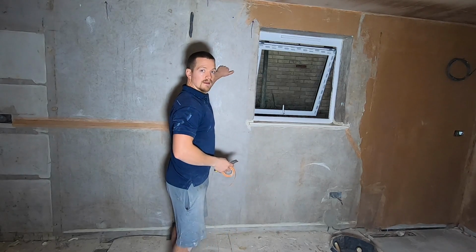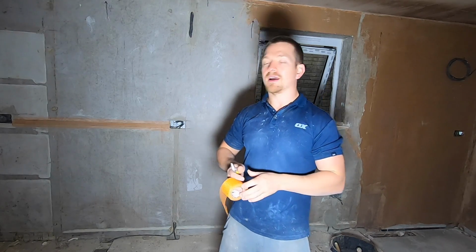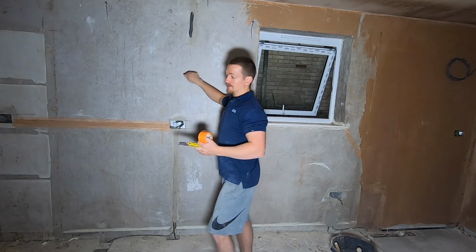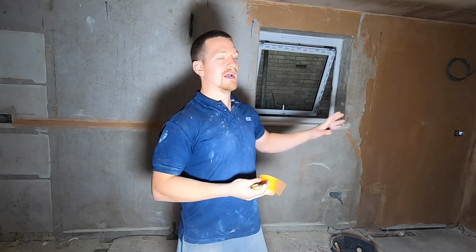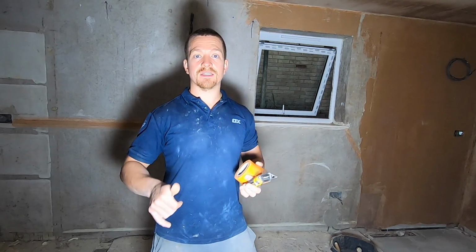And obviously before you start any work, tap your walls. If there's any areas where the wall feels like it's a bit hollow, then you have to hack it off and start again. You don't really want to be plastering onto a drummy surface. This is rock solid everywhere. So first of all, cover your cracks up, but more importantly, check that you haven't got a wall that's really badly hollow or a wall that's basically going to be unsafe to plaster on. So that's the first thing you want to do.